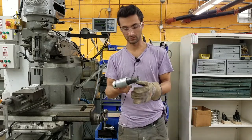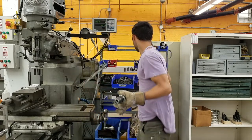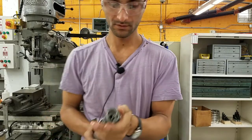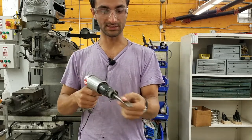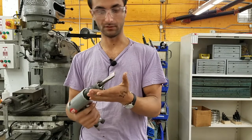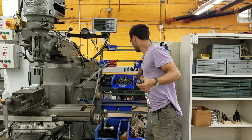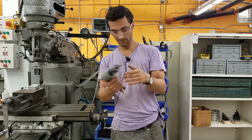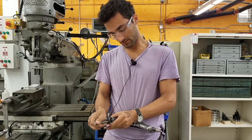This is a pneumatic impact hammer, or air hammer — it's just a hammer. You can put a tip in it: pull back the spring and drop your tool tip in. It smashes forward and backward rapidly. This tip, for example, has a little notch for sitting under a nail head to cut the head off a nail. You can also use it to smash stone, concrete, or other hard things going into concrete. There are a whole bunch of tips here for various purposes — it's effectively a really powerful hammer for smashing things. The speed control is on the bottom, and the tip releases like that.